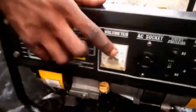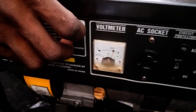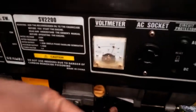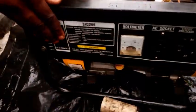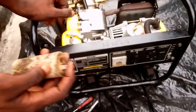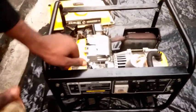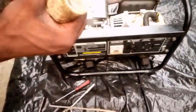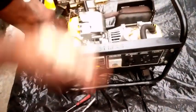If you look carefully now you can see this — see this movement. That is it! We have successfully changed the capacitor of this generator from a very dead one to a new one. What this shows you is that when a generator's power goes off, most times — 95% of the time — what is majorly at fault is the capacitor. For a generator like this, it is usually the capacitor.